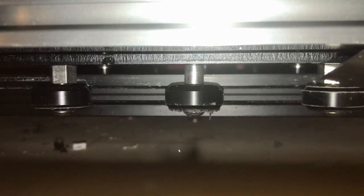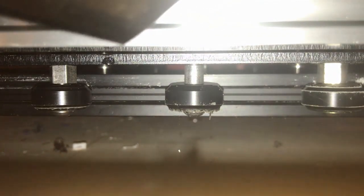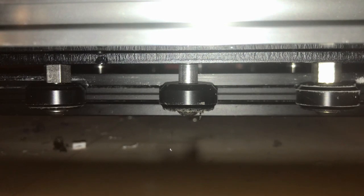What you'll notice is that starting here, we have a nut above the wheel, then it alternates — we have a roller above the wheel, nut above the wheel. Those nuts are called eccentric nuts, and what they do is they don't actually loosen or tighten the wheel. They put the wheel at a very slight angle compared to where it's sticking out perpendicular. As you rotate this nut, you're able to rotate the angle of the wheel very slightly. So if you rotate it into the rail, you actually tighten the two wheels. The squeaking you're hearing is from some of the wheels and bearings being incorrectly tightened — they're brushing up against each other and that's creating the squeak.